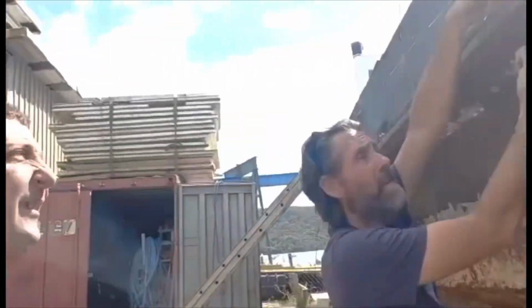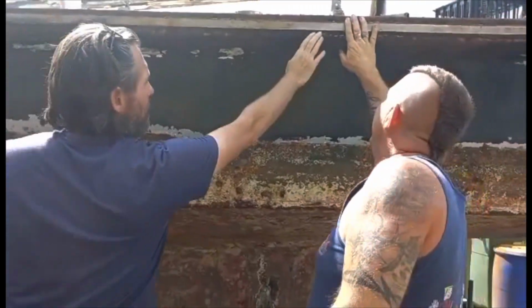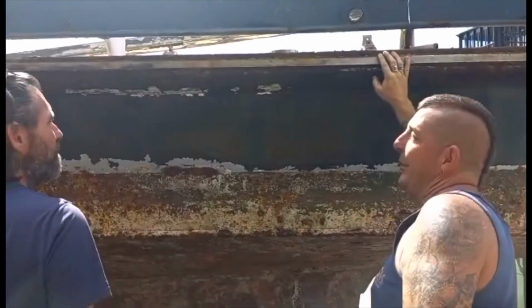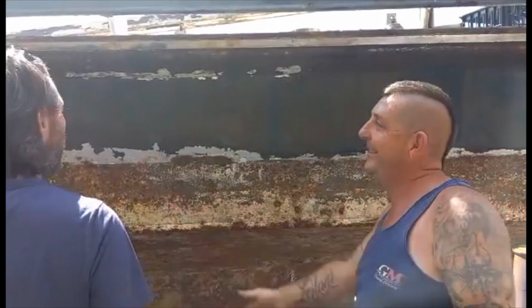I was thinking take that narrow 1-inch edge off. Yep. And then just a stainless steel flat bar all the way across. So cut it right here and here. Or even, if it cleans up all right, just a doubler over the whole thing. So you reckon if I just needle gun all of this, then we'll see how bad it is. If not, then I'll just get the 9-inch grinder. Maybe. I reckon you're better than that.